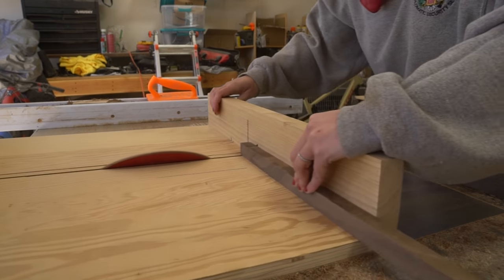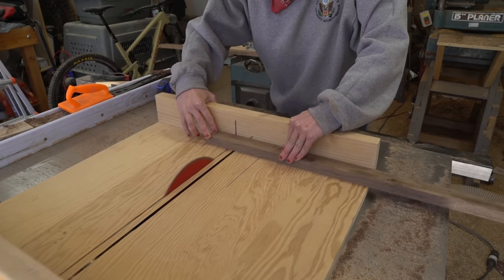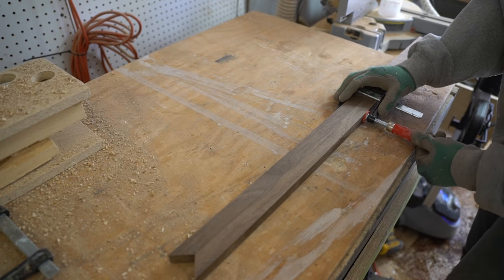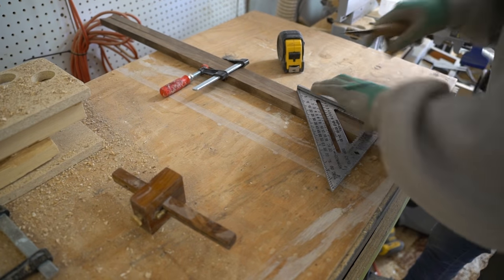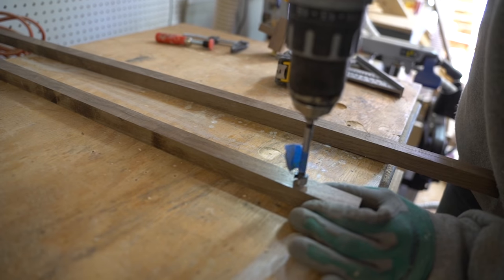Speaking of, on one end of two roughly 1-inch by 1-inch pieces, I cut a mitered corner so that the rack would be able to swing away from the outer frame. Then, after clamping the interior frame pieces together to expose the mirroring faces, I used a knife and square to mark the height for each spindle and drilled the mortises.